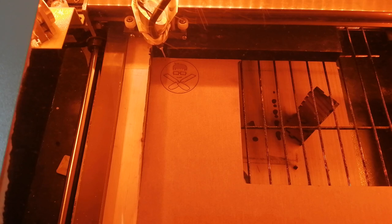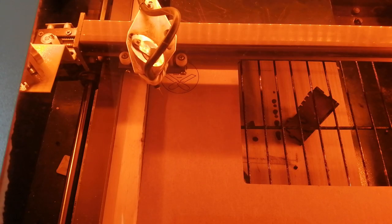One second. So I've now got that set to 0.04. We'll drop it down to 47mm just to drop below the other one, keep the raster engrave at 500, and we'll get started on that one.